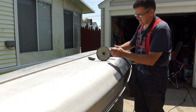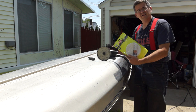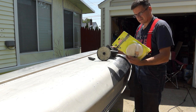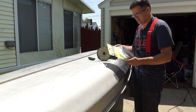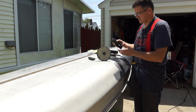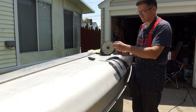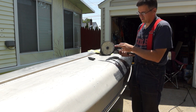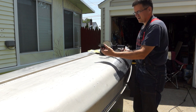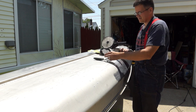In order to do that, I picked up a set of discs from Ryobi — a six-inch buffing and polishing wheel set. It's actually for a bench grinder, so I picked up an adapter so I could use it with my drill. All it does is screw through the center and you're good to go. You can switch it around and change directions every once in a while to clear the aluminum that builds up on the wheel. I put it down to the ground on the concrete and that clears out the aluminum. For the aggressive wheel, I use a black Harbor Freight compound.